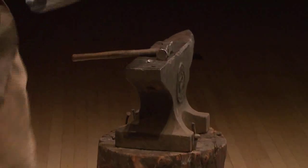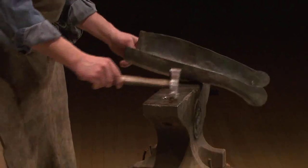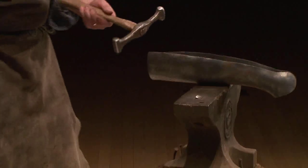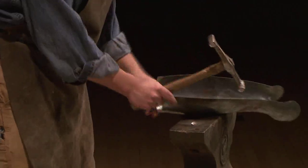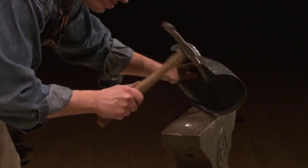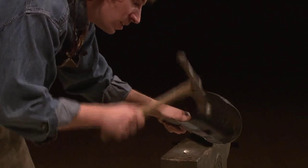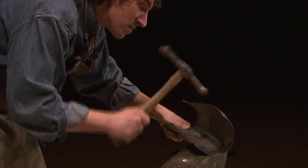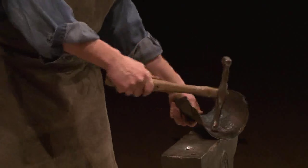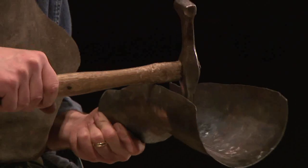And to get these bumps out, I would planish, okay, hammering from the inside. And you can see, just an ordinary hammer like this is going to be difficult to get in there. So I actually have specialized hammers that are like this. So now, when I want to get to the inside of this piece, now I can do it. You can see how this hammer with the long head reaches right in there, okay, and allows me to hammer and planish the inside of this plate.